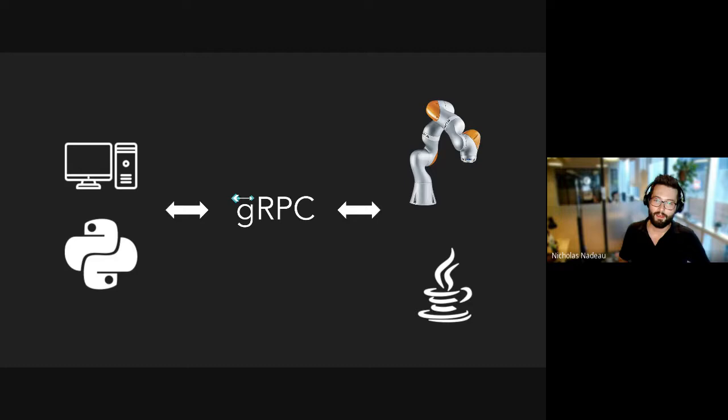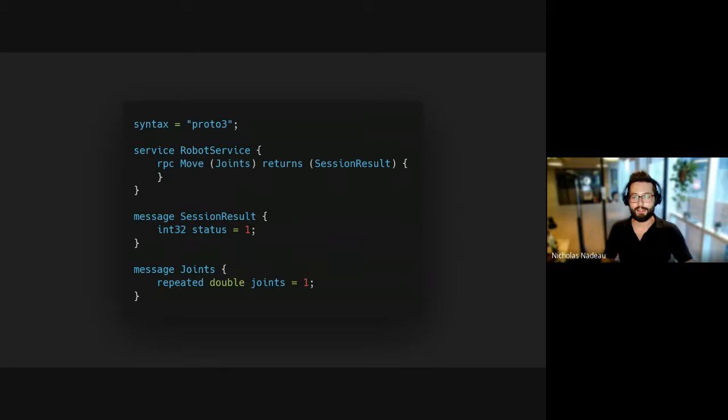So to solve the communications issue, for me, gRPC was the answer. So now we're going to go deep into some technical implementation, talking deep about Python and networking and things like that. And so this allowed me to create a client-server model between the robot and my Python data science stack. And so the robot was essentially a server in the eyes of the data models and the training algorithms. And so the function callbacks from the optimization loops would actually call blocking server functions on the robot, which would make the robot move or do something physical. And so the return value from these function callbacks was the actual data collected from the robot's onboard sensors, like the force sensors and the torque sensors. And so this allowed us to do robot in the loop optimization.